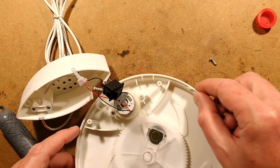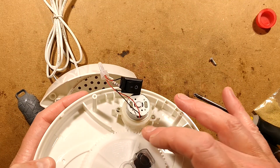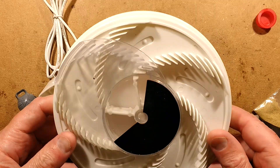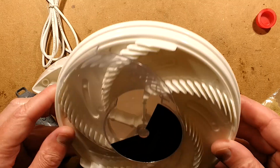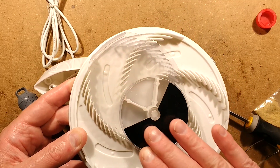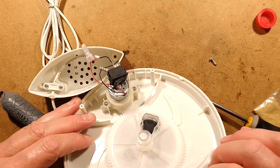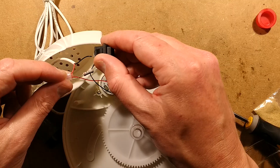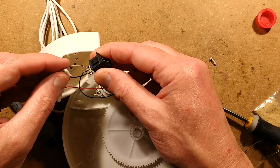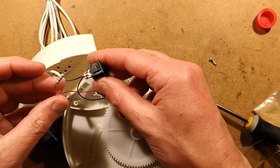Fundamentally, that is just a geared motor - low voltage, geared, going onto the side of this wheel. That's turning not just the wheel with the little trap underneath, but also turning the plate on top that covers the flies and ushers them into the middle. Very simple. I'm perplexed about that resistor - I kind of want to test it without it. Did they mean to put it in series with the motor, or is it just what happened?